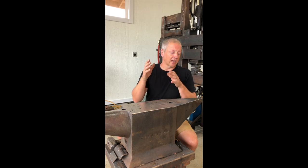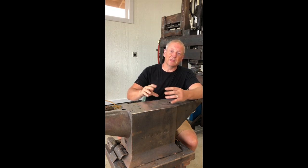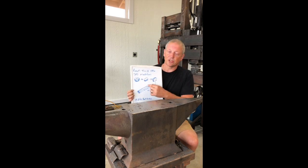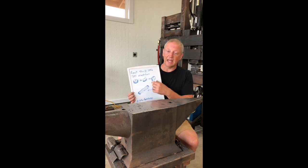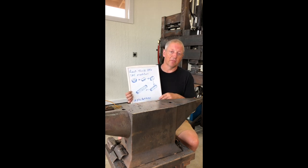When I'm working under the press, I start working down towards a disc, and you'll see me work the ingot around so that I'm pressing everywhere as evenly as possible. I will start to work a little bit on edge to begin setting the direction I'm going to be stretching the material. You can see I've illustrated that: rather than going down to a disc, I'm starting to develop some flat edges. Part of the reason for this is simply that the width of the opening on my forge is limited. If I went to a disc completely, I might not be able to get it back in the forge.